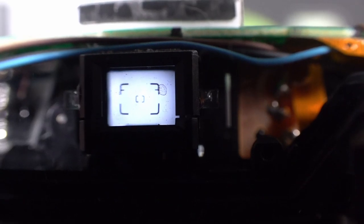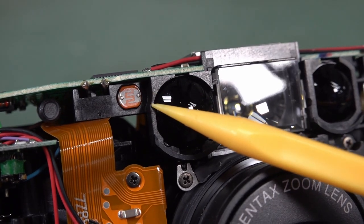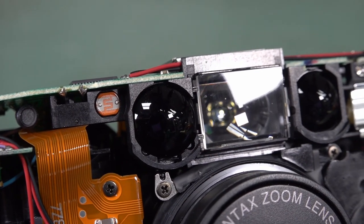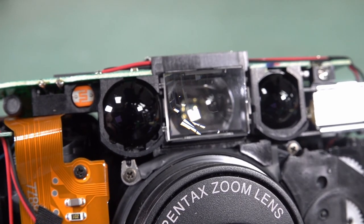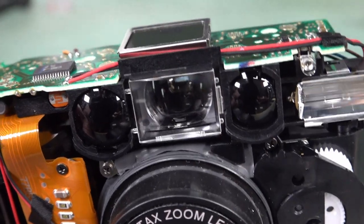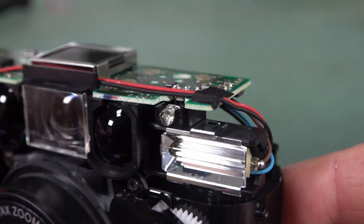Give you a look through the old school viewfinder — there you go, that's the scope over there. This is not through the lens — none of that SLR rubbish. It's got various indicators on there that will show up — you can see the framing, focus framing, and I think there are a couple of other enunciators on there as well. And I spy with my little eye a little CDS photo cell over there, measuring ambient light level. And of course the transmitter and receiver for the infrared — they're just going to be lens modules with an infrared LED and an infrared photodiode. There's the flash there.